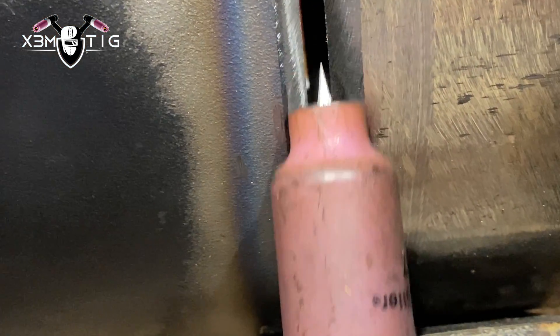This is a really good opportunity to show you all those things you've been asking about. For the tack, I'm going to put a root tack on this one. Settings are 1.8 tungsten, cup size 8, 120–125 amps for the root. With the 1.8 filler rod, just keep that filler in the middle — once you connect both sides, keep it like a lead wire to get a nice, proper root protrusion. We don't want anything too beefy, just connect both sides and you should have a nice solid root tack.